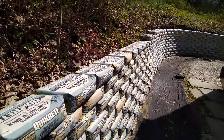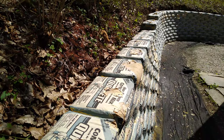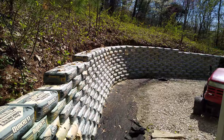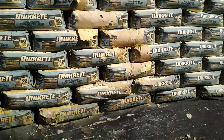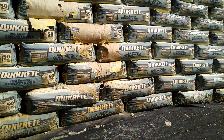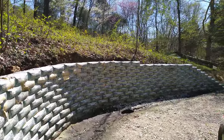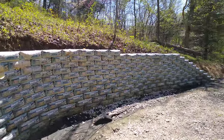The backside has number four stone and eight ounce cloth, and the water runs down, hits that, and goes right into the bottom of the backside of the wall, then comes out some of these pipes right here. I put in pipes every so often and that keeps the water pressure off the backside of the wall. Then it bends around this way and the French drain goes all the way to the edge of the drive.